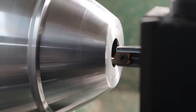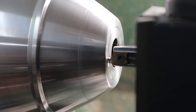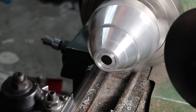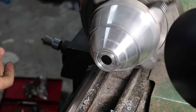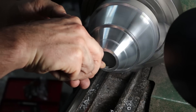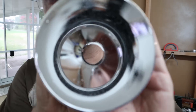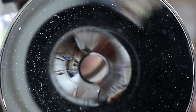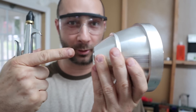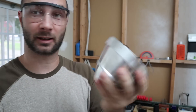Next, I enlarged the reflector bore so that it would fit nicely around the 3590 emitter. Pro tip: always blow in this direction first — you'll get far fewer scratches on your reflector when cleaning it.